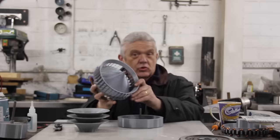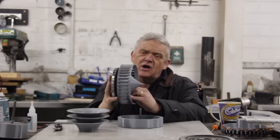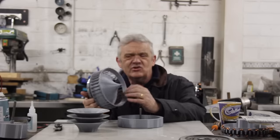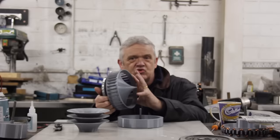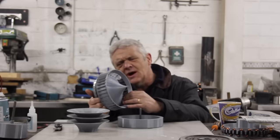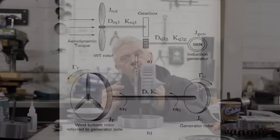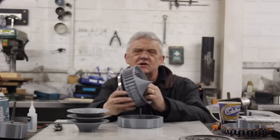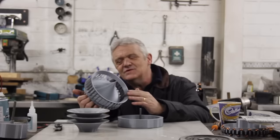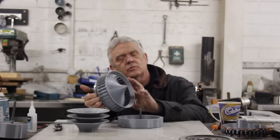I have reasonable faith in the Waters turbine design because it's been well explored and tested. But how do you measure how well your wind capture device is doing? This bit captures the wind and turns it into rotational force — and to measure that rotation is to measure the torque. We can measure the torque on the shaft that the wind is blowing on and making turn. More torque is better; less torque means we need to rethink.